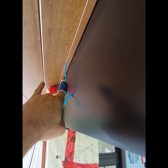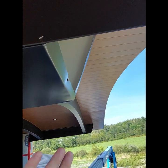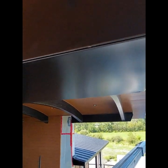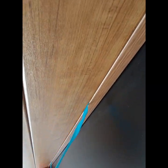I pulled back the backing of the two-way tape, made sure it was level, and I have four inches distance here and the same here. I set up my zero point with four inches distance — I'll have to trim the tip to have the same angle as the other side. Then we'll do the cap and the finishing wood trim between the two curved beams, the glulams. Right now I've got my four inches and it's level, confirmed four inches in the middle too. I'll just keep removing the backing and stick this section up as I go.